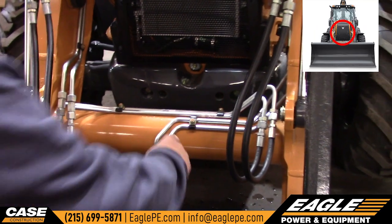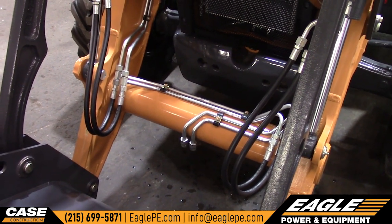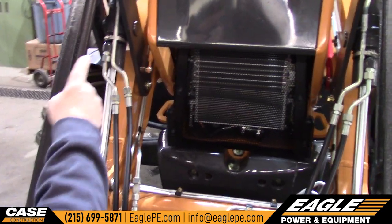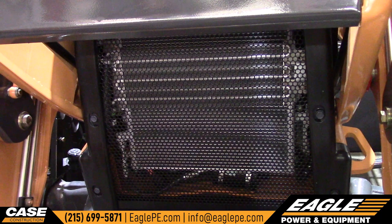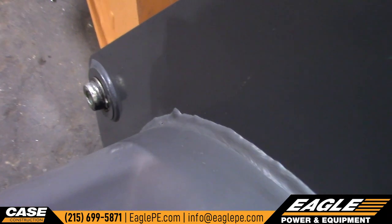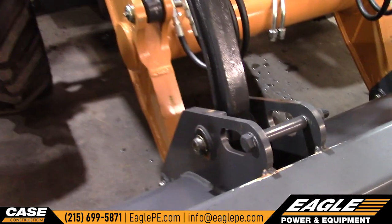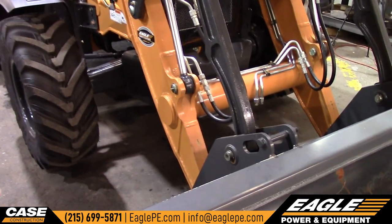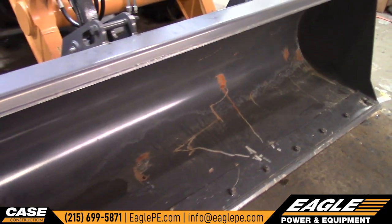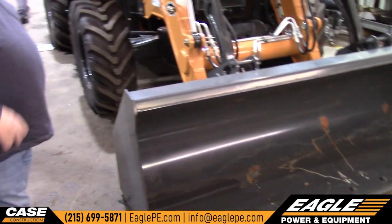At the front of the machine, this machine is equipped with third spool hydraulics — it is an option, it doesn't come without you ordering it. Also in the front, it makes sense to put a screen on the front of this to keep material from packing. All these machines have a greasable loader lower pin on the bucket — especially if you're a salt guy, you really want them to be greased. The bucket is a 590 bucket, which is a wider bucket than what comes on a regular 580. It has a 590 front differential, which is wider than a 580 differential.